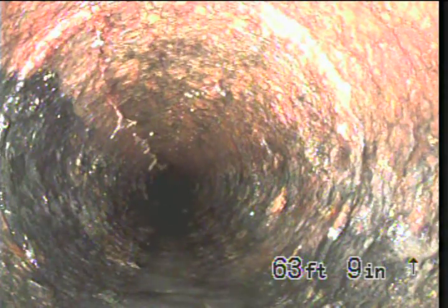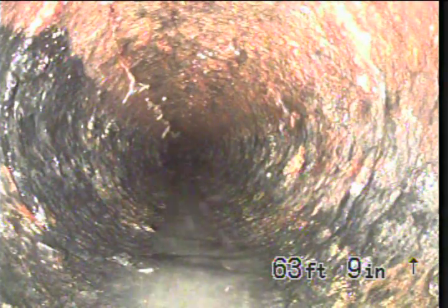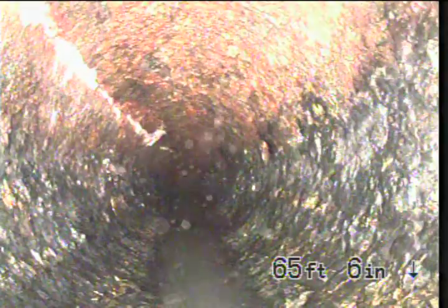That line on top, there is a line at the top running at about 11 o'clock. Right there, I can see it. You can see it's kind of got a, now it's at 12 o'clock right in the middle. That suggests a crack in the pipe. Now we do see them on top where they leak out if they're exposed, but this isn't exposed. That's the only sign I've seen of anything that might be indicative of a problem with the pipe. You can see the white line again. It's kind of at the top left corner as we pull back right there.